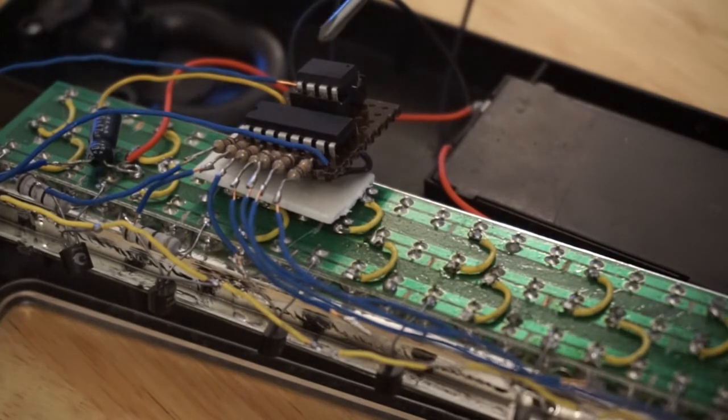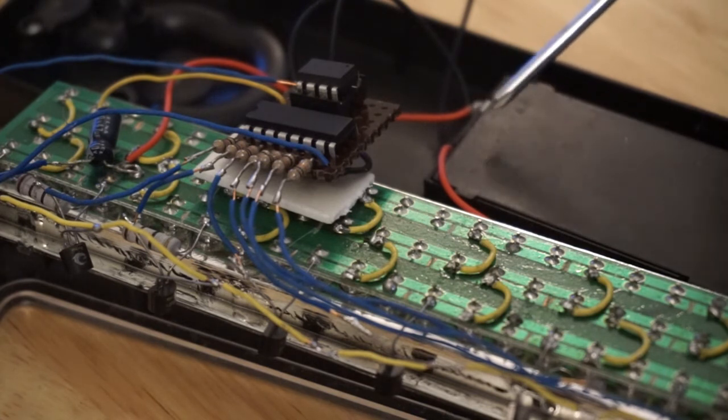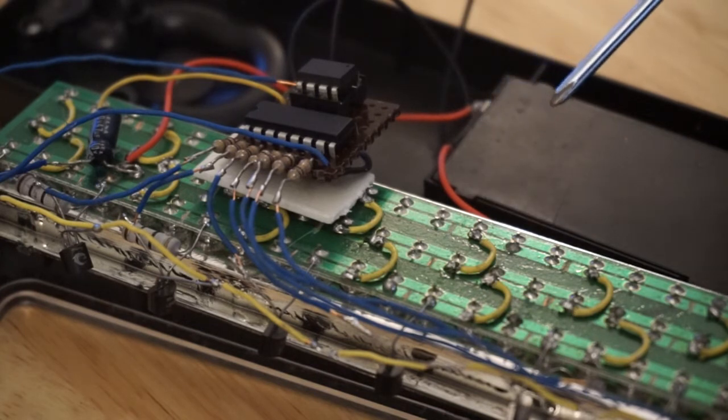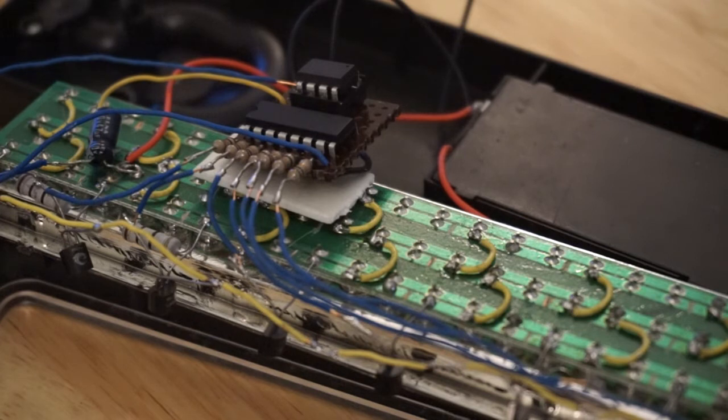The microcontroller is powered more or less directly by the worklight batteries themselves, which are 4 AA nickel metal hydride rechargeables. As there's no regulator, I cannot actually use alkaline batteries, as this would take the supply voltage to above 6 volts, which is too much for the ATTiny 85. Initially, I tried this modified worklight without any decoupling capacitors. However, I found that switching between modes would sometimes result in the circuit glitching and locking up, and then it won't respond to anything.